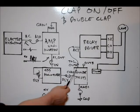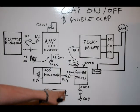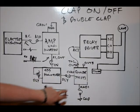There are four outputs to the counter: Out A, Out B, Out C, and Out D. You have to watch the 74LS93 tutorial linked below. We have our AND1 pin connected to ground so that the counter isn't in constant reset mode — if you leave AND1 and AND2 floating unconnected, the counter will not cooperate. We're going to connect our variable pulse width output from the 555 to the clock plus, and the counter toggles states on the falling edge of the pulse. So we'll clap, and as soon as the pulse falls back to zero volts from the monostable multivibrator, the counter will toggle.